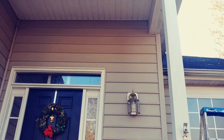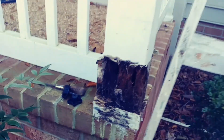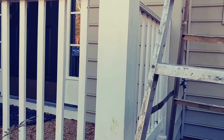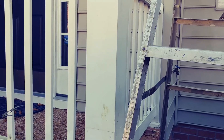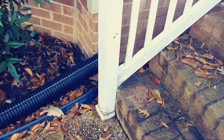Today I'm rebuilding a porch. As you can see, it's one of these hollow core posts for the column — it's rotted off. I'm gonna replace it with a treated six by six. The six by six comes five and a half inches wide and this is five and a quarter, so what I'm gonna have to do is rip that six by six down, take a quarter inch off each side. We're gonna replace all this and do a little bit different with the design.